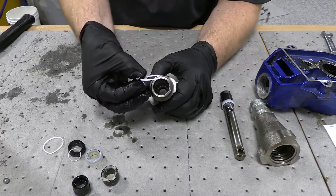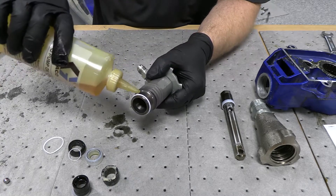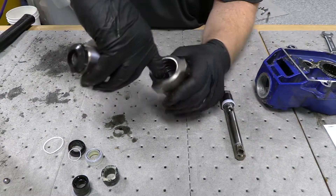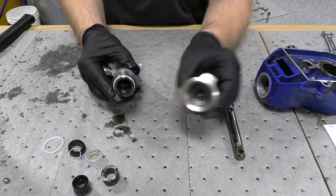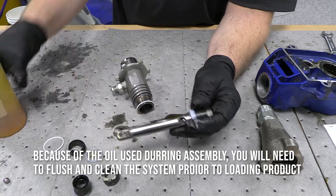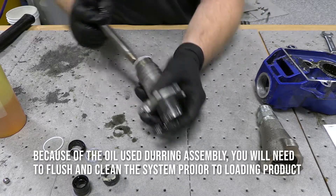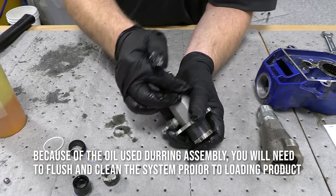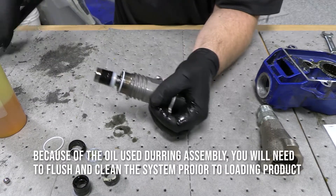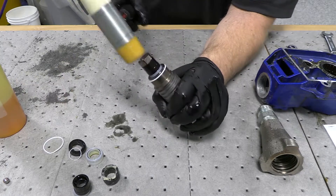We also have to put this new Teflon ring on the bottom. This slides on. I'm going to use a little bit of oil to assemble this so that later on it slides inside of here and it actually seals on the inside of this together — so we need a little bit of lubricant on there. Now we have to put this back inside of here. This is going to go back through our seal up on the top, so a little bit of light oil on all of this. Get very careful to make sure that that's lined up really good — don't screw up the seal.